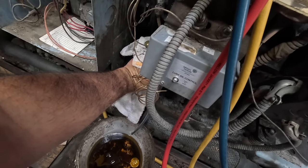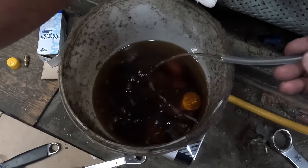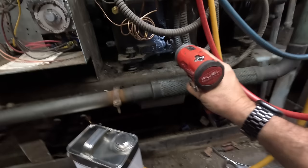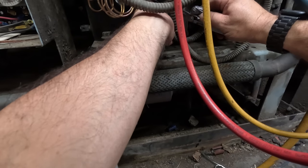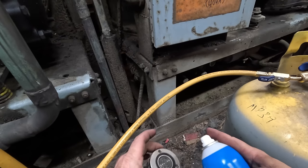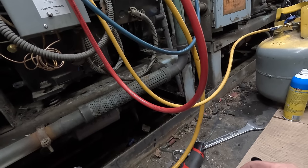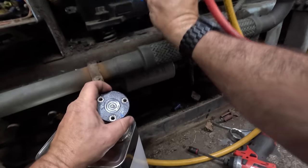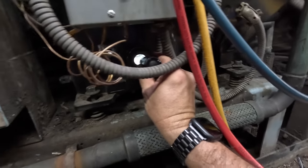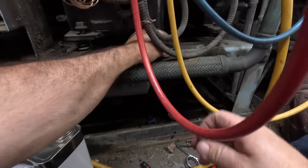Basically, you're making a pressurized vessel here. You can see that oil doesn't look too horribly bad. Like I said, it doesn't scrub the pipes like it's going to here in a little bit once we run the other stuff. Alright, we got the oil out of it. I'm going to yank this oil sight glass off the side here — I don't usually see them recessed like this. Brake cleaner evaporates really quick, and as long as you're using non-chlorinated, it won't kill you when you're welding on it. Let's take a peek in there and see if we see anything horrible. There is some oil in there yet. You see the screen? We've got a little bit of oil in there. Let's get this started back by hand and get that oil screen cleaned out.